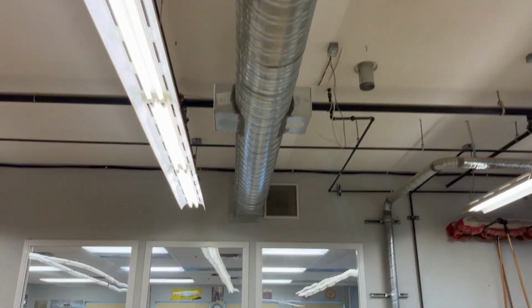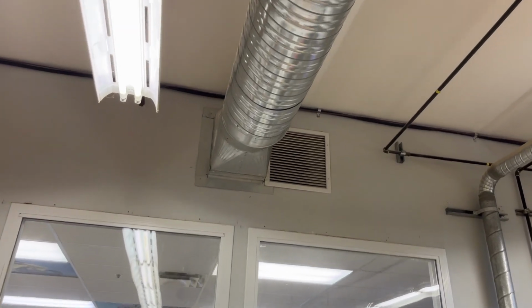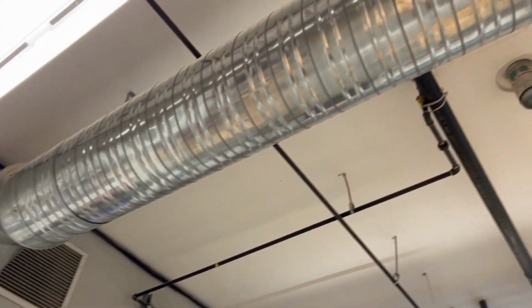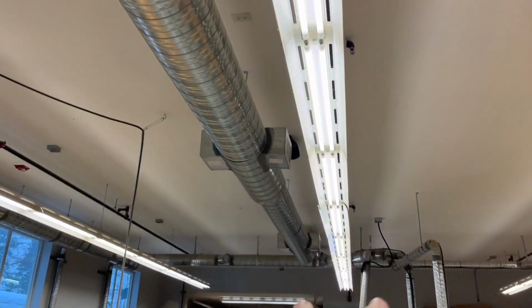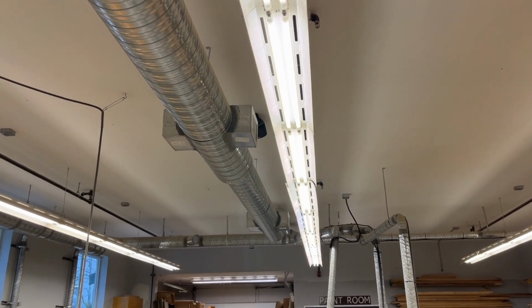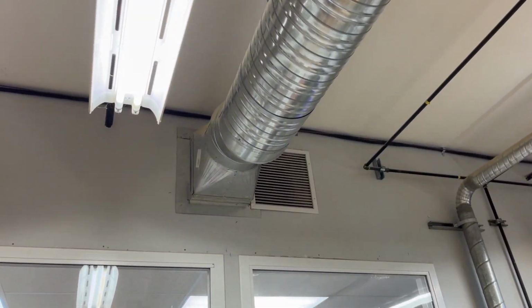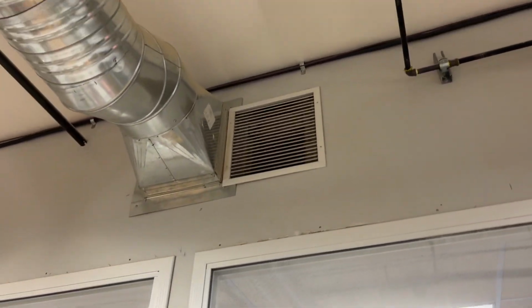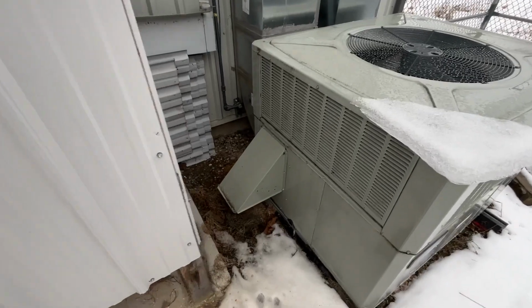You know, I've been giving some thought to the balancing of this system. Our vent ducting and our intake ducting are the same size. And then the vent duct itself is very non-restrictive. There's multiple openings all the way along. And so we've got 2 18 by 18 inch openings. That's a balanced system.